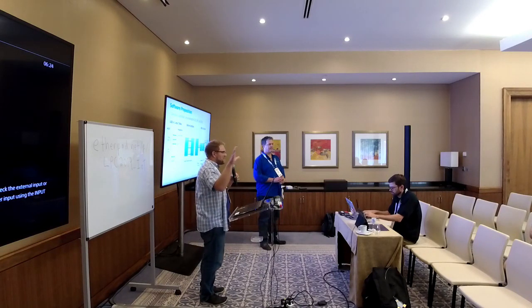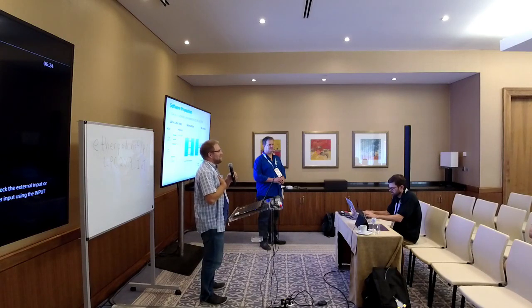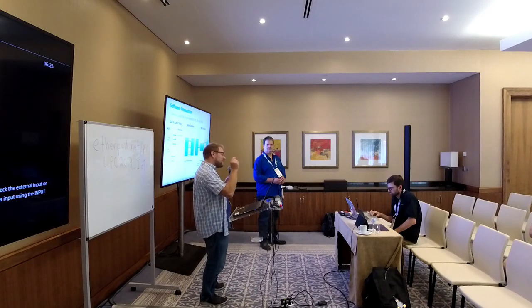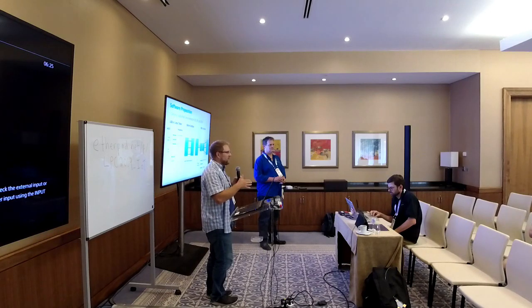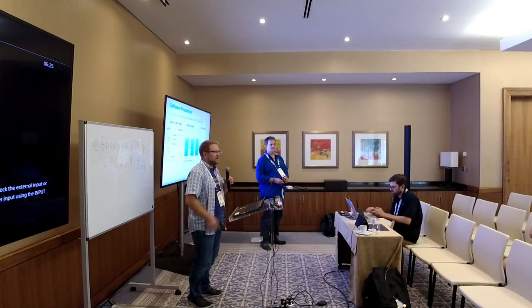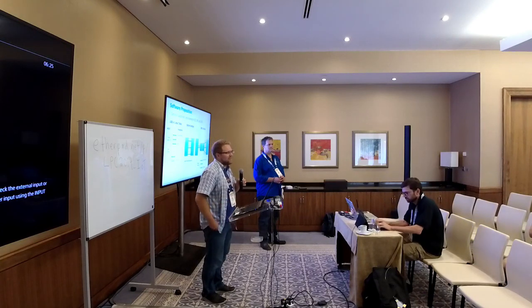Stefan, you had brought up that great slide comparing all the different real-time operating systems and their various support for 802.15.4. I almost wish you had done the same thing for BLE, or at least maybe we had, because the initial prototype we had was this close to working on Contiki with BLE. I should clarify too, the thing that we were focusing on was to use IPv6, so 6LoWPAN over BLE and 802.15.4. So it's just a unified socket layer. And ideally, we would really love to have LoRa as well, accessible via socket and addressable via 6LoWPAN or something like that.